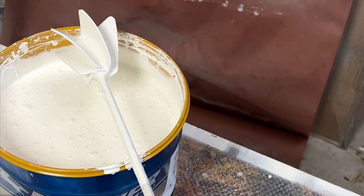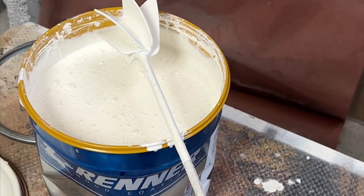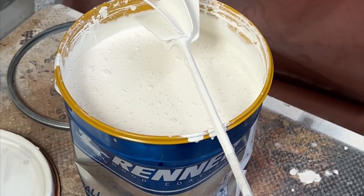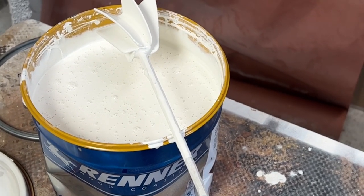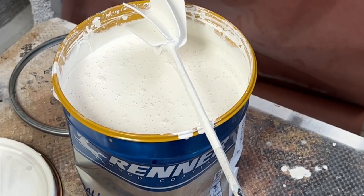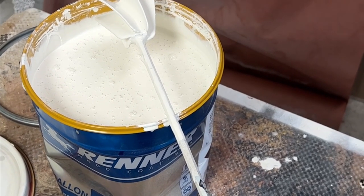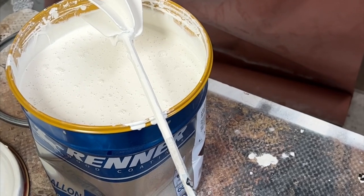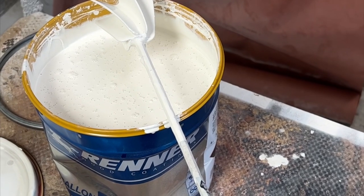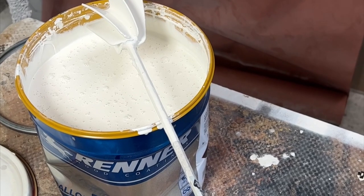I prefer to do two light coats on each side. Some people spray heavier — if you're using an airless you might spray a little heavier than what I do, but it all depends on what tip size you're using. I'm using a small tip, an air-assisted airless, doing a light coat probably close to three wet mils. I used to spray heavier but I still sometimes had to spray twice, so I found that doing two light coats at about three wet mils each I get better results than trying to spray a heavy five to six wet mil coat.